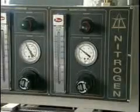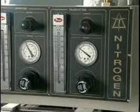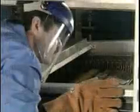The nitrogen flow rate should be adjusted to provide the desired reduction of oxygen in the atmosphere. Now observe the wave. Your documentation will let you know whether there is simply a laminar wave or whether the assembly requires an additional turbulent wave. The height of the solder pot and the waves must be set so there will be proper solder coverage.